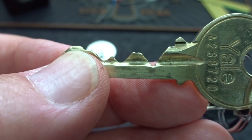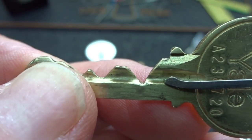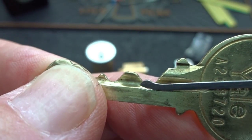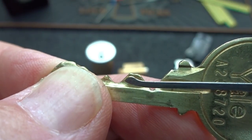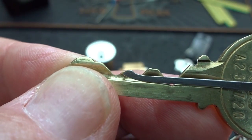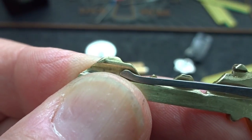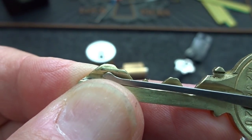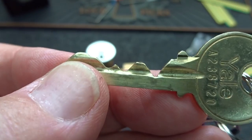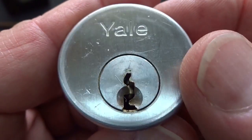What this does is force you to take a pick and slide it down the keyway. Let me grab a thin pick — when I slide it down the warding, as soon as I slide that pick down there, that first pin is automatically over-set by the thickness of the pick. I may be able to pick some pins if I'm lucky, but look how many of the other previous pins I've over-set. That's why in the lock sport community we violate MACS all the time.